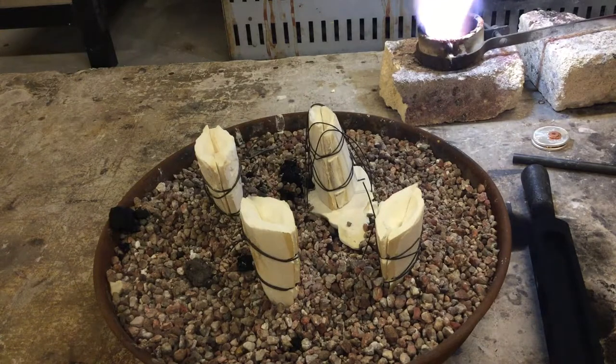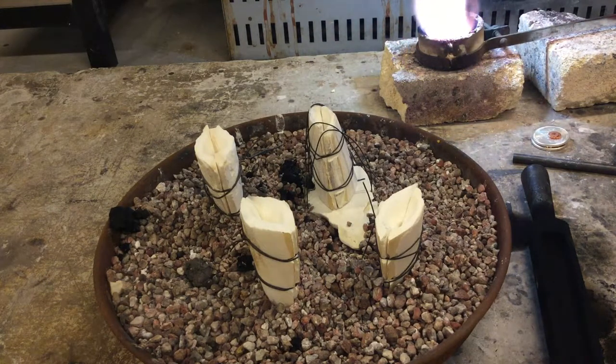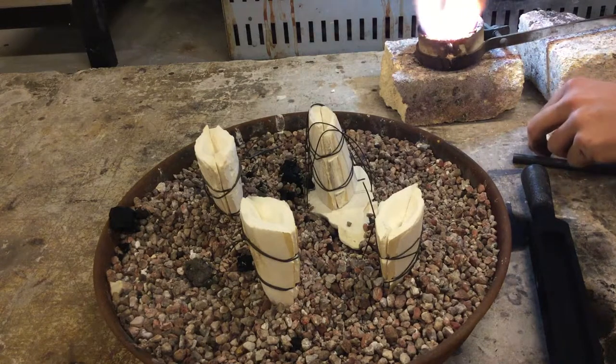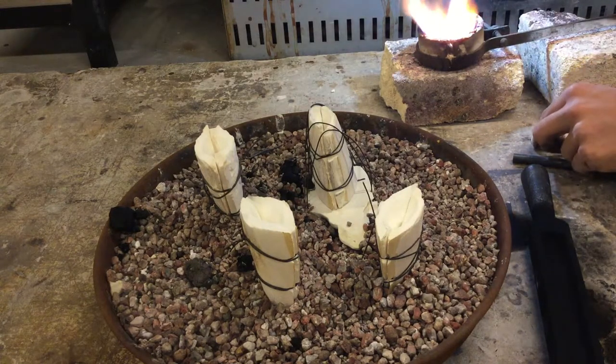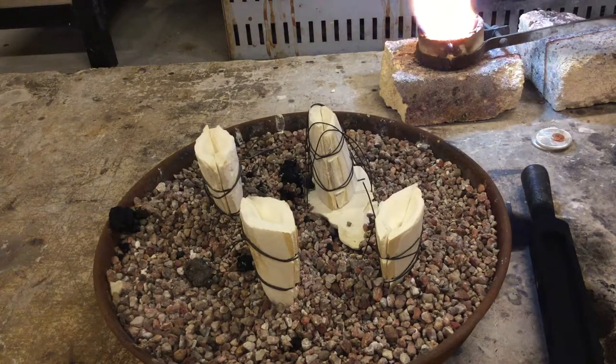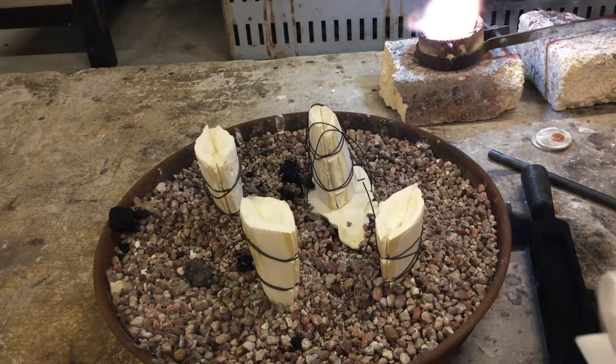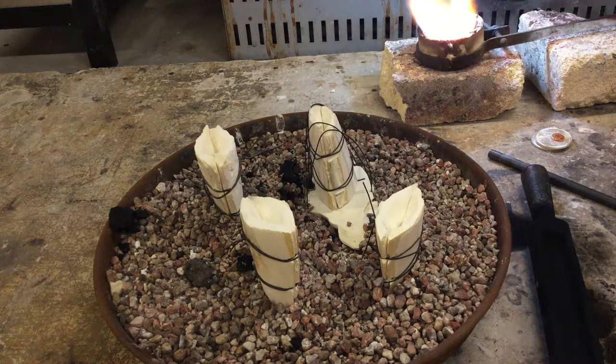Needed to be purged from the line. We're going to preheat the crucible. Once the crucible is radiating color, we're going to add our metal to alloy, and then once that happens, we've stirred thoroughly, we will add our regular charge of pre-alloyed metal.